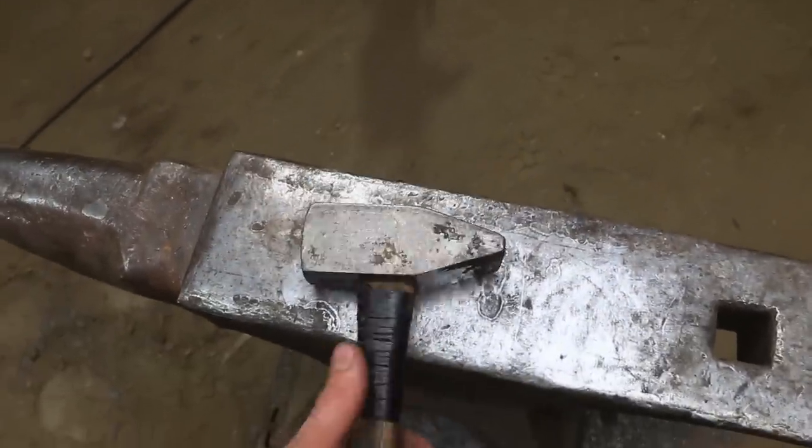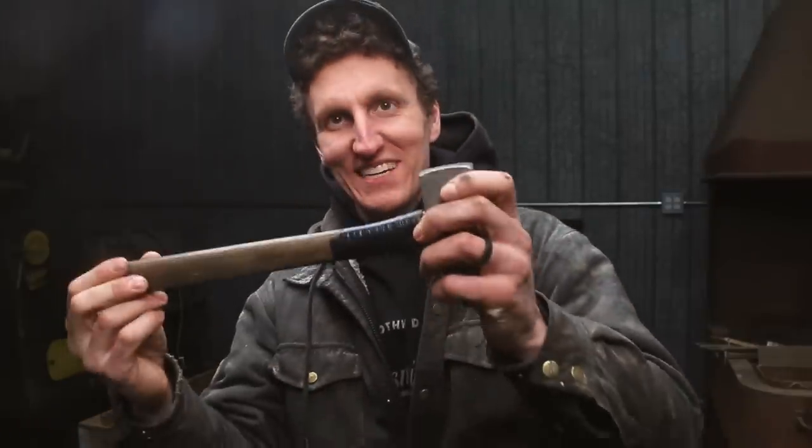That's where the hammer is after over two years of working it. This is the reason I haven't made the video — you look at that and say, oh, that's not a very good hammer. Look how loose that is — I gotta fix that. The surface condition is not super great, but for forging axes I like the texture. I don't know that I would want to sell a hammer like this. You can harden titanium to a degree — I was messing around with age hardening it in the forge, but I'm just not set up well enough to do it. If it was hardened it would be a little bit better, which would be exciting. I need to put a new handle on it soon — a bit longer to get a little more speed.